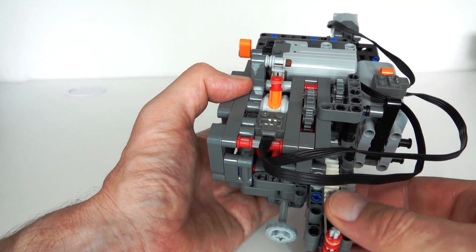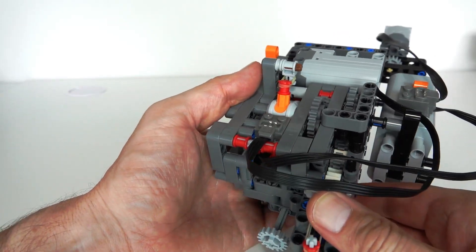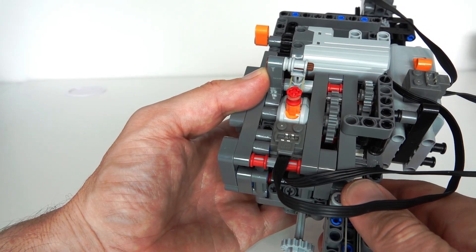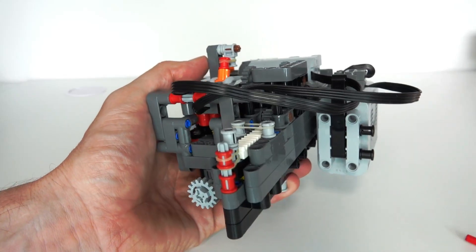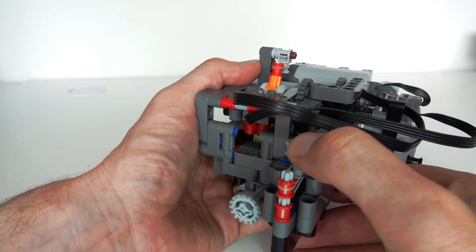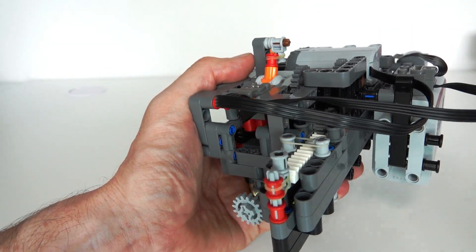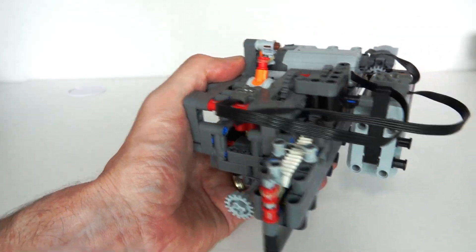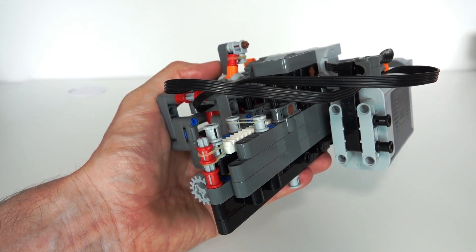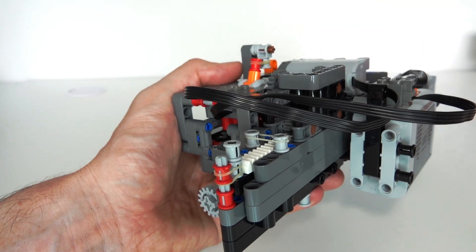That mechanism is implemented in the gearbox on the right - you can see the gear rack with elastics, and the gearing that converts from the small 8-tooth gear onto the electrical switch. As I move the gear rack across, these gears don't engage until it reaches the right distance, then the electrical switch rotates and switches gears through the servo. It goes from gear one to gear two, then with further movement to gear three. I've got more resistance from rubber bands so it has to push through more to reach gear three. As loading is removed, the gear rack moves backwards and the elastic bands restore the switch to the original position.